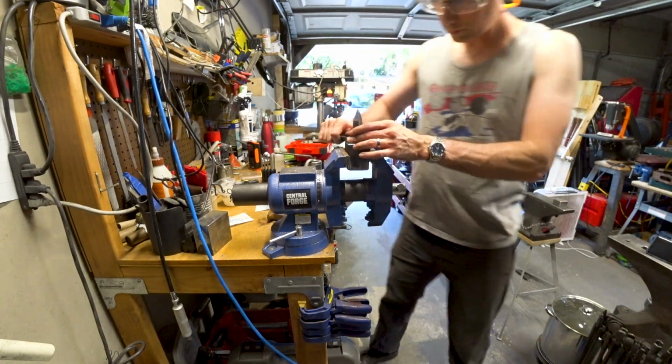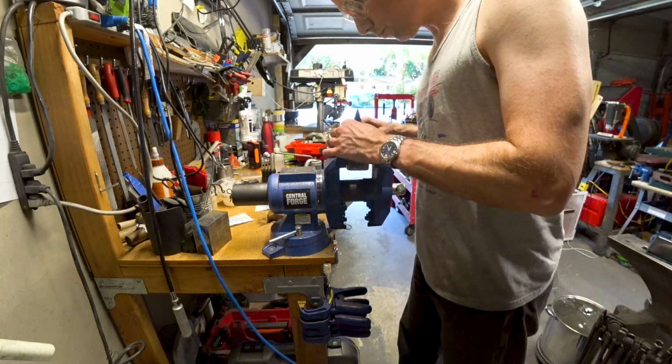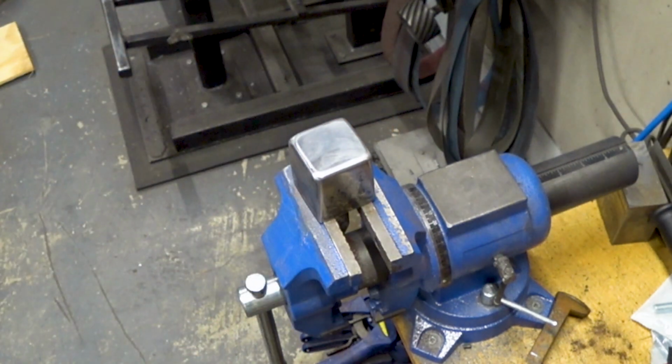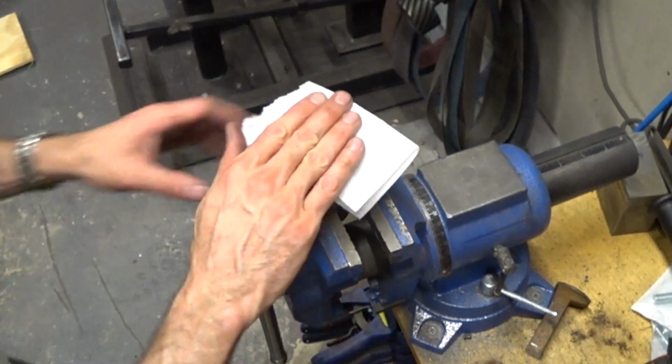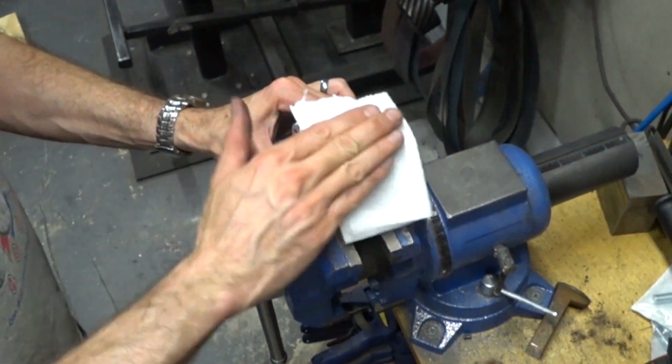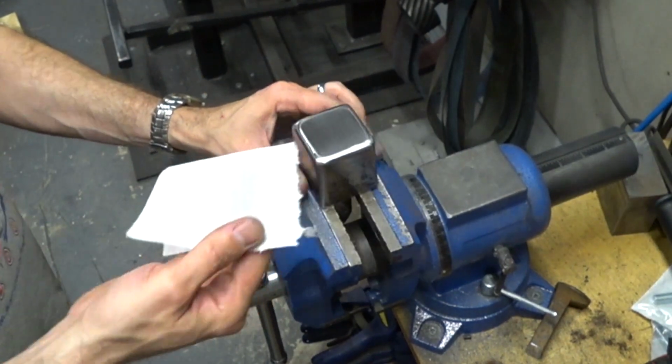If the sledge that you started with was fairly hard and the temper didn't get ruined as you are doing the build, then this bad boy is pretty much ready to use at this point. Since the sledge I started with was fairly soft, we're going to need to heat treat it in order to get the most out of it. So next video I'll show you how to do that, as well as how I constructed the base to mount it on.